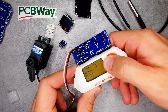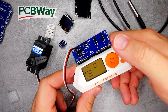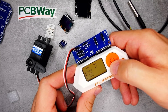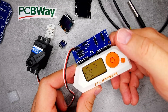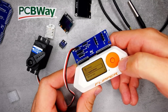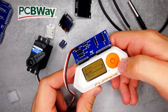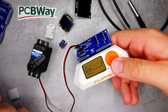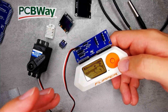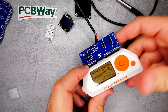As you can see, if I move it incrementally it works, but if I try to make a bigger movement when the servo draws higher current, it just switches off the 5-volt output. The good news is at least it does that and doesn't damage your Flipper Zero. Now it stopped because the GPIO is turned off. If you have one of the smaller servos it should work without issues, and at least you can see there's a failsafe built into the Flipper Zero.